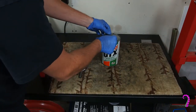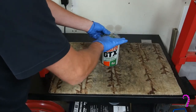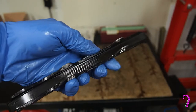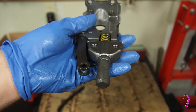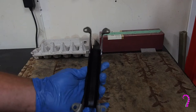We can reseal the CCT and put it back on the shelf. Now we check the guides and other contact surfaces for damage or excessive wear. If all the parts are good, we can box them up until reassembly. And from looking at these, I don't see any reason to replace any of these components. We can just move right back onto the head itself.